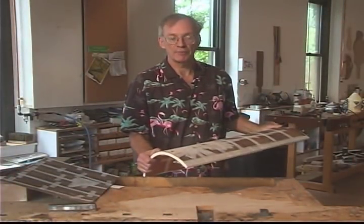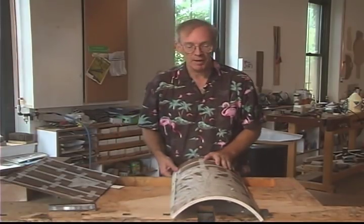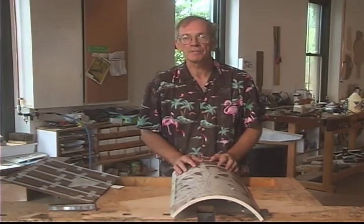Now I'm confronted with the tough task of getting that tape off of there, and to do that I'm going to use scrapers and sandpaper and just a lot of elbow grease. I have veneers in the marquetry going in all different directions, so the scraper can rip out the wood fibers and I want to be careful not to scrape across the grain. For this reason I don't go all the way down with the scraper — I stop while there's still a little bit of tape left on, and then use sandpaper to clean up the rest of the panel.